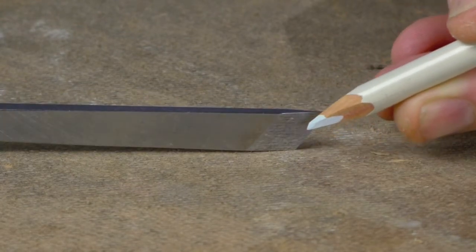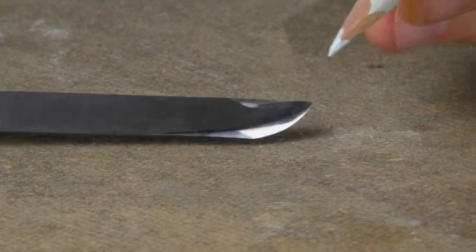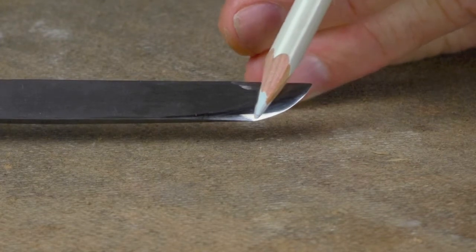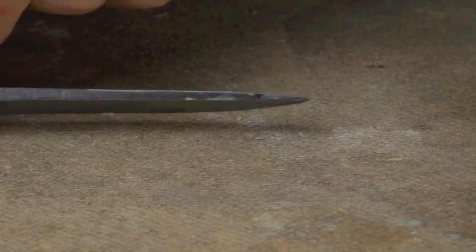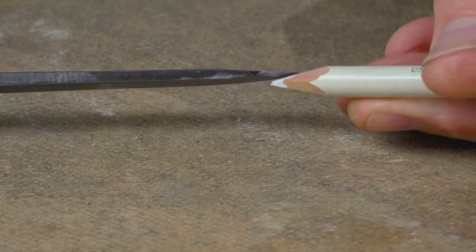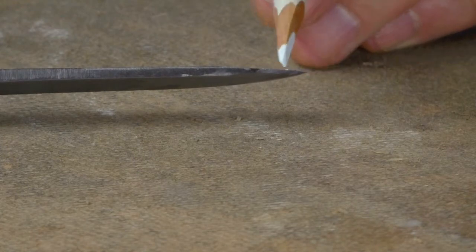What I've done on my skew chisel here is I've modified it — I've taken away that corner altogether and made a cutting edge that goes all the way around and along here. So this is all a cutting edge, and at the same time I've thinned the back here on either side, which makes this point here much keener.